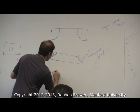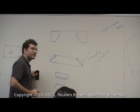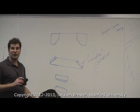The way you use these is imagine the inner race sticks out. This is the inner race. And then on the other one, this is the inner race. What I'm about to tell you is only for super ridiculously nice bearings. Misumi has these, and they're $110 a pop per bearing. So if you just go to your car shop and say, I want an angle contact bearing, this probably doesn't apply. So what you do is, say I have a hole, a mounting hole.